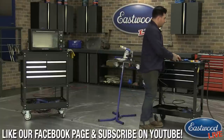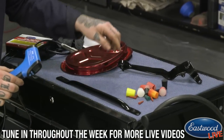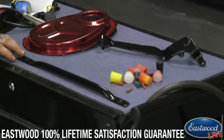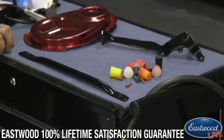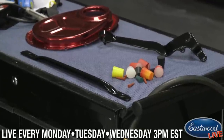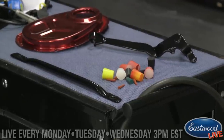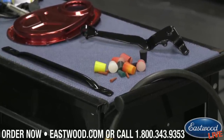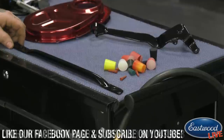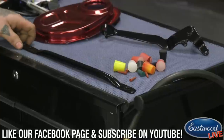What we did is we went ahead and powder coated a couple of the parts. I chose gloss black. We'll show you guys the gloss black that came out on two of the parts — the pedal and this bracket here. They came out real nice because we took the time to blast them, get them really clean, and wipe them down with pre. They came out pretty much blemish free, very little orange peel. There's a nice smooth finish — actually a little bit reflective. And this is a single coating, no clear added.